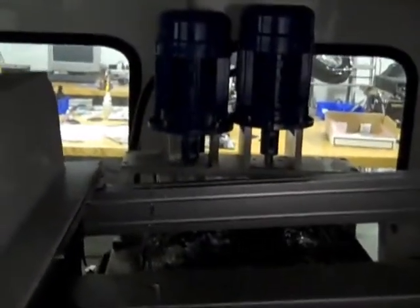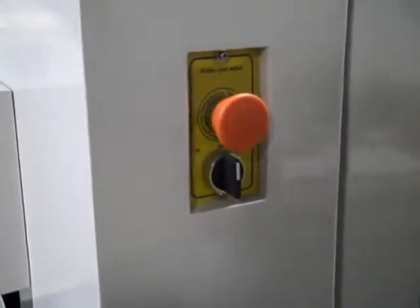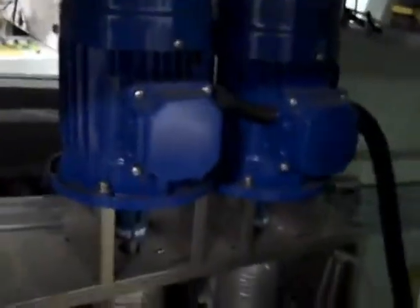It's a two impeller system, as you can see with the titanium fingers right through here. It does have all of the temperature controls right here. Coming around this side, here's the output side of the oven, the safety tree, the status tree, and on the back side there is also a safety switch as well as a solder pot insertion and removal. The solder pot can be removed and drained. Here are the two impellers, and there's access from this side as well.